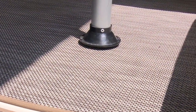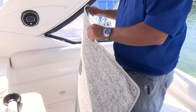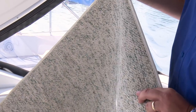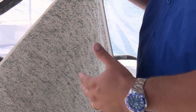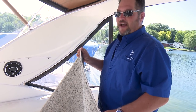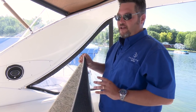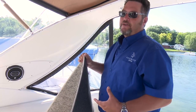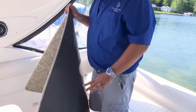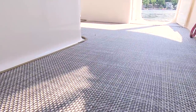Overall it will look far better. Here's a look ahead at the finished floor covering fabric with the table post installed. One of the things about the old carpet — and I can actually smell it right now — is they put a rubber back on it which helps it grip. But what happens is the carpet gets soaked from spills or water dragged in from swimming and it just never dries. I had carpet pieces out for three days in a building where they wouldn't see any moisture and they still weren't dry. The new stuff will be far better because it isn't going to absorb water, so it will dry faster and overall be a better fit.